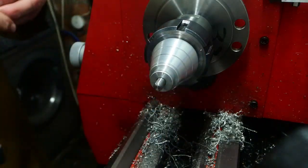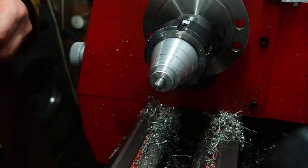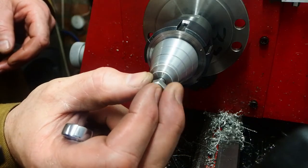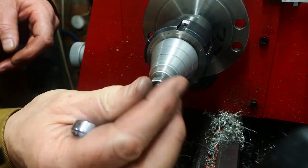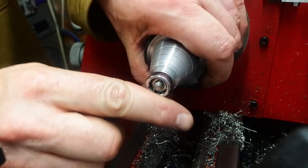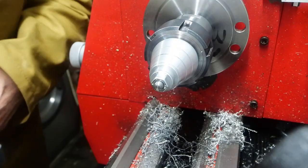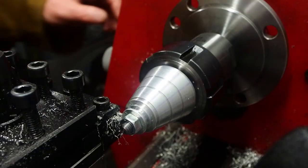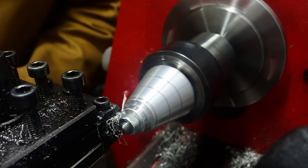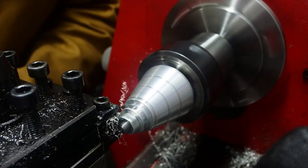Having made the stud, I could mount the skirt on the stud. At least I could if I used the right size washer. But there's one more feature to take out of the end of the 15mm spigot. There needs to be a groove for an O-ring. The rubber O-ring is just going to provide some friction to stop the whole thing accidentally coming apart as it dangles from the clip or the belt or wherever I choose to dangle it from.